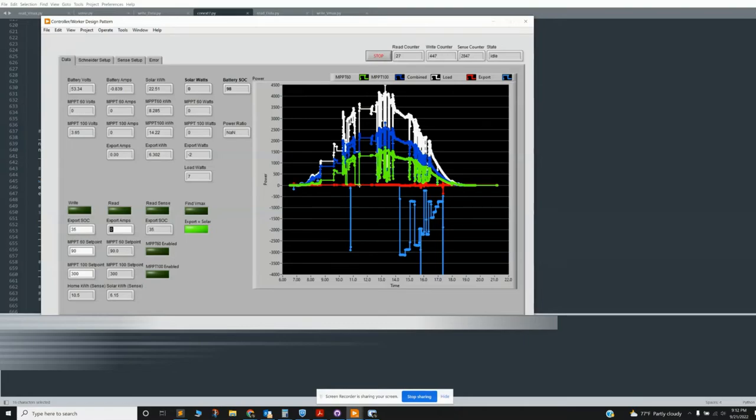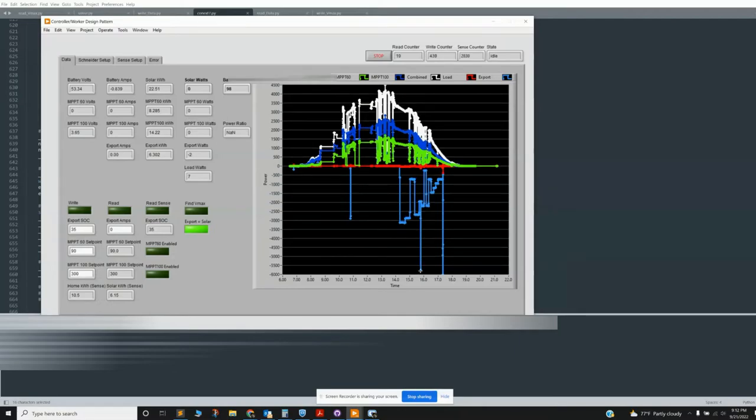And easy to program. One thing you'll see are these spikes. I have not figured this out yet, but essentially, randomly, the inverter likes to just dump full power into the grid for a few seconds. Earlier in the day, it happened before 6 o'clock, and this was a real event. But these two events are the inverter just running free, even though the export amps are set to a fixed value, it just blasts the grid. And I've noticed that when I open the car door of the Tesla, it frequently does it. So I don't know if this is some weird interference noise thing, but really the only way to make sure that you're never ever going to export is not by setting export amps to zero, but by turning the grid support function completely off. I don't have that programmed in here, but I easily could.